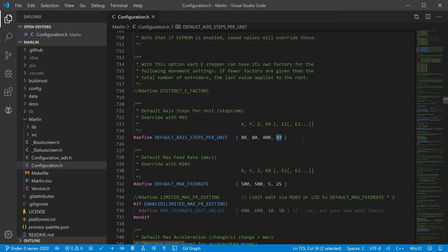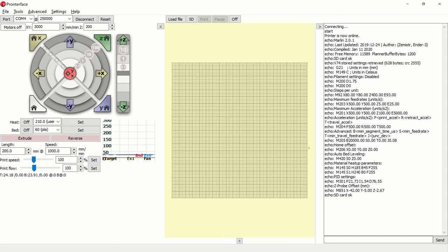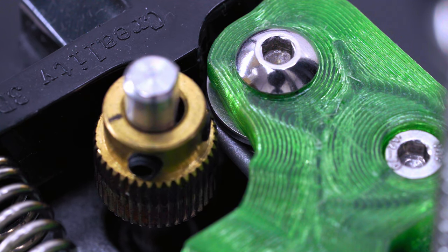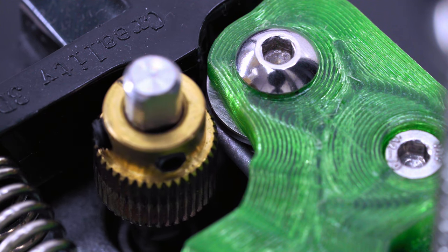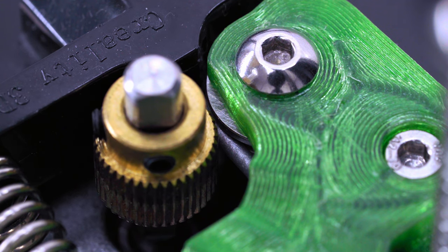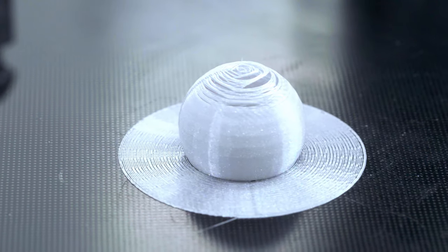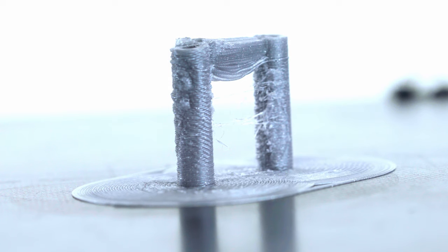At the end of the list, I see E93, which is the current number of extruder steps — my extruder has 93 steps per unit length, which is 1mm. The value for the first extruder is at the 4th place. If we have multiple extruders, we will do the calibration for each separately. If we are building the firmware from scratch, we will use 100 steps per unit as our starting point. The calibration of the extruder is a conversion of motor steps to a unit of length — when we tell the printer to move the filament by 1mm, it should move exactly 1mm. If the extruder is not calibrated, the resulting print could be under-extruded or over-extruded. The under-extruded print is fragile and may have gaps, while the over-extruded print will be thicker but inaccurate.